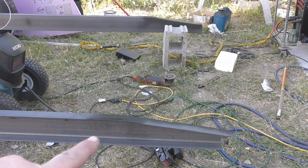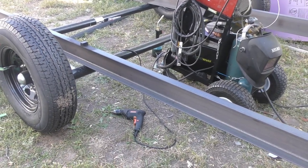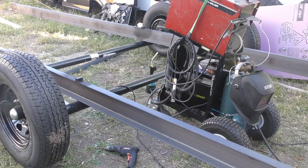All right, so we got those two sections finished off, welded up, ready to fly. And then we got our little bump stops. You see we got a bump stop there, bump stop there. Those are gonna sit on the axle while we do the rest of our figuring of where things go. So now that we got that, I need to grab a couple lengths of C-channel and some ratchet straps. Then we'll ratchet this thing together and we'll see where we need to adjust and straighten up.